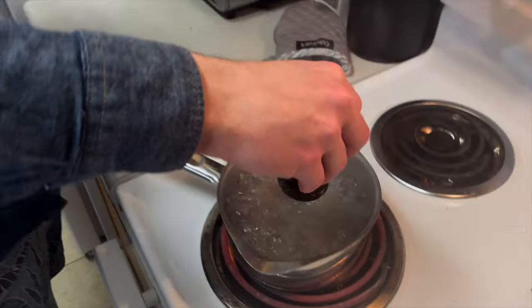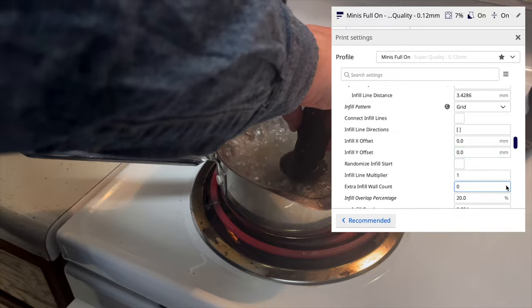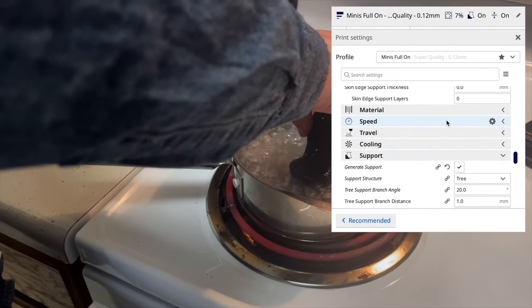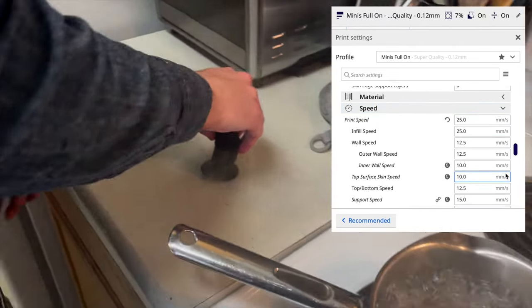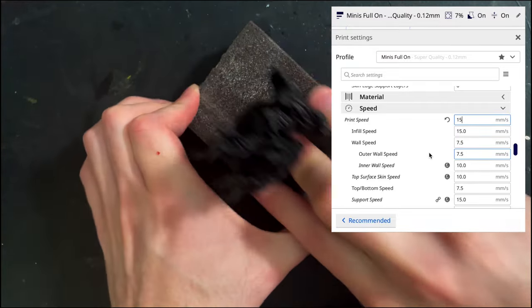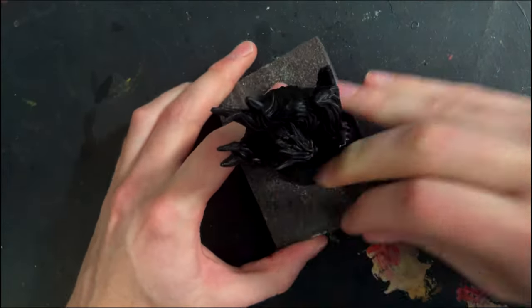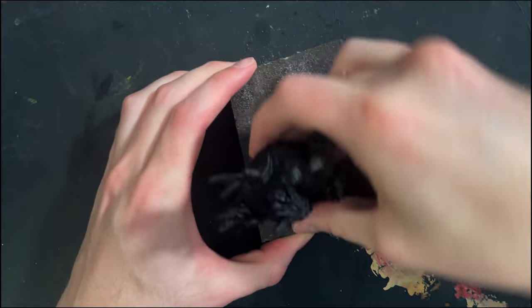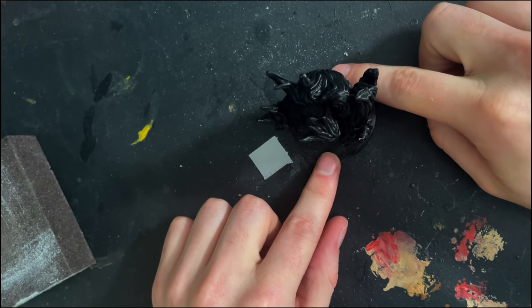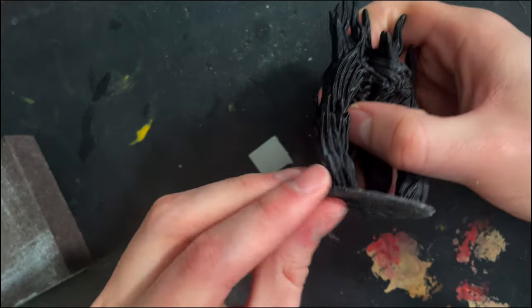What are some other things you can do? You can spend a lot of time dialing in your slicer settings. Generally, the slower you print, the better the end result will be. I also like printing slow because it kind of artificially conserves your filament. You can also print with a 0.2mm nozzle — you should be doing this if you're printing miniatures on an FDM machine. And then you can dial in your settings for your supports.